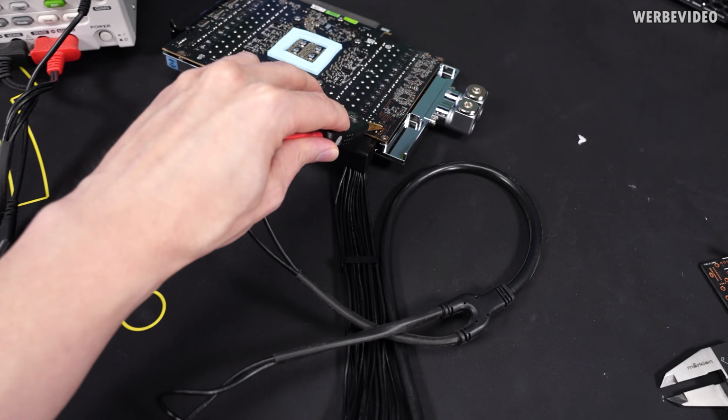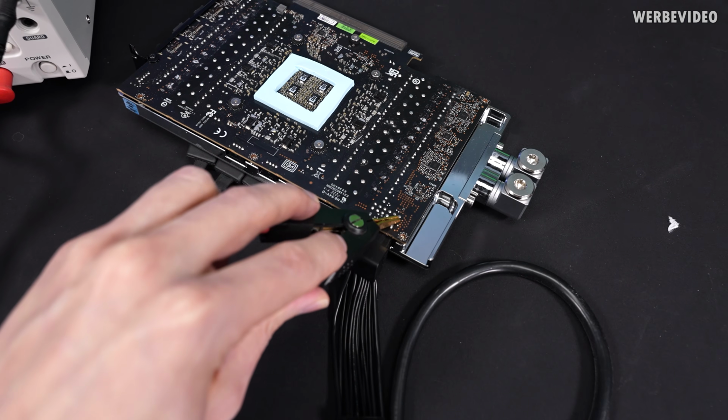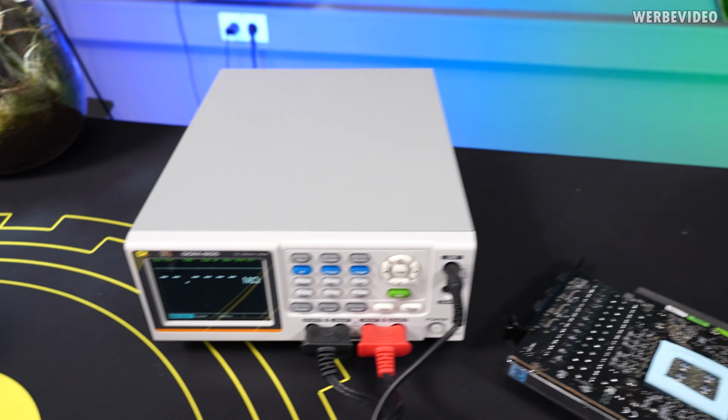The measured resistance will be partially the cable itself and then the connector or the mating resistance inside the connector itself. At this point I also had no idea how many pins are affected or if there are even pins affected. The only thing I could directly find out was that there was a bigger fluctuation between the pins in terms of contact resistance, and that on pin 6 I just couldn't measure any resistance at all, which means that there was no connection, which was weird.